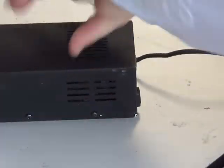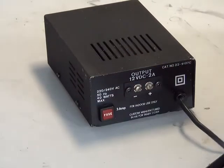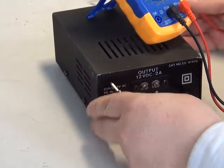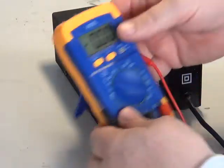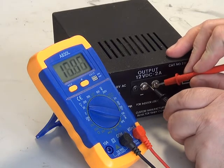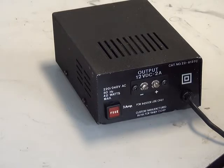So I'll just turn it around. It's a double insulated product, so it's a 2-core cable, but it's a metal case. I'm not quite sure how that works, but obviously it's approved. I'll just try and put our trusty cheap meter there. Now it's offload, so it's 17 volts. So this will only become anywhere near 12 volts when it's on load.